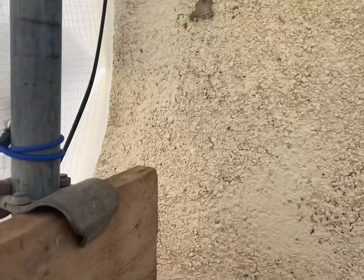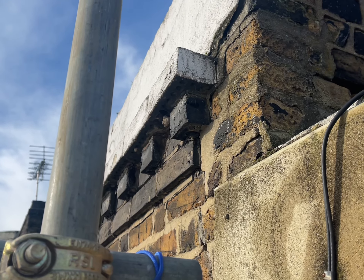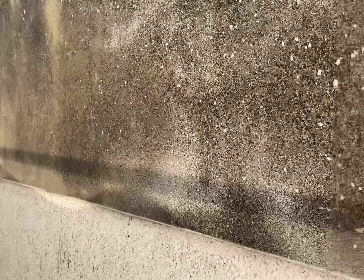We're going to be doing some stone restoration here. Up on the top elevation on this parapet wall, what we're going to be doing is taking all of this off and hopefully replicating this Kingshead brick style all the way through. But until we take this off — it's all completely blown anyway — we'll see what we've got to work with under there. If not, maybe we'll go for a new cornice band going all the way across. The customer is quite undecided what he wants to go for yet, but once we get it all off we'll give him some options and ideas to work with.